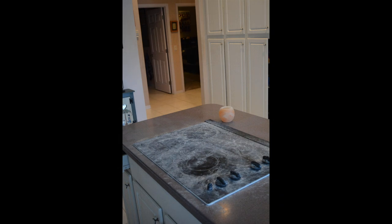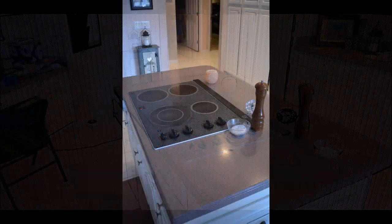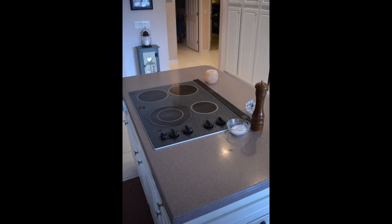The other tip is to apply some sort of powder to the surface, like talcum powder. This will make the surface reflective for the scanner and you will be able to get data off the surface. If you use this method, the resulting scan will look something like this. Once you're done, just wipe off the powder and you'll be back to what it was.